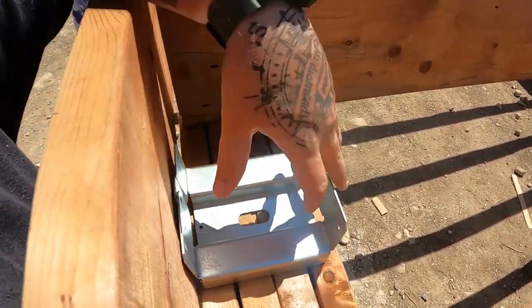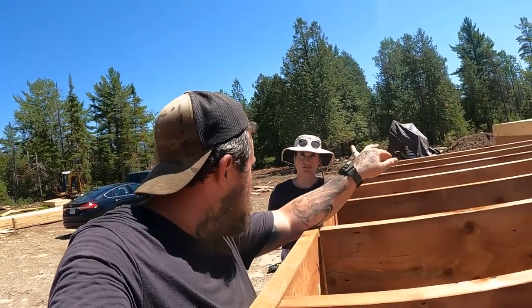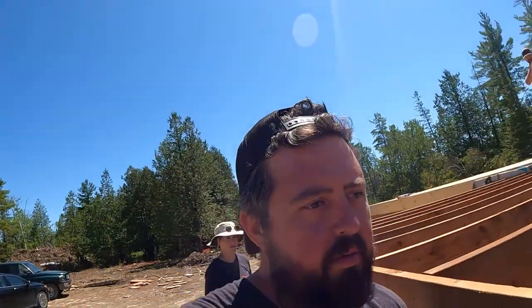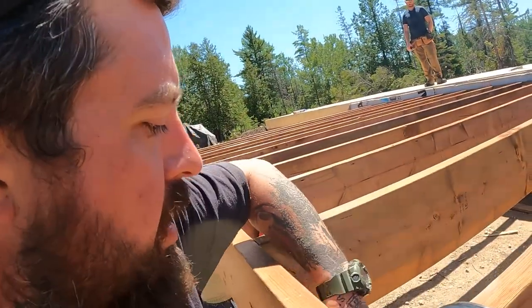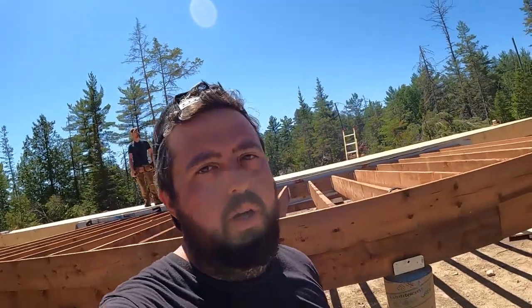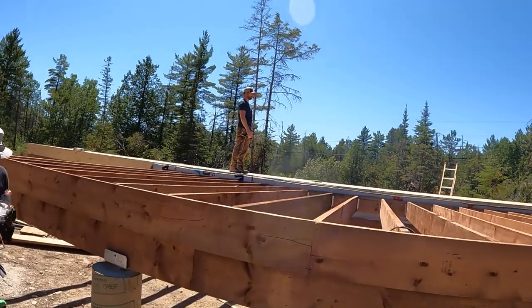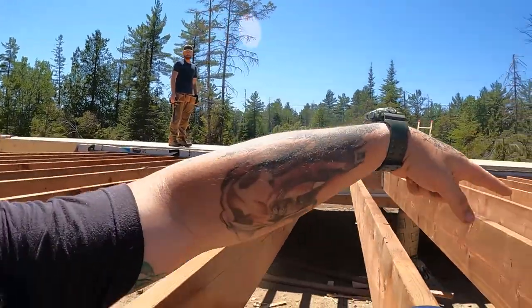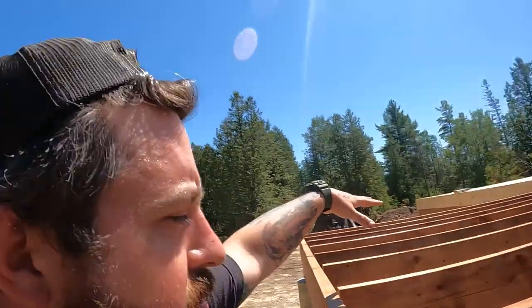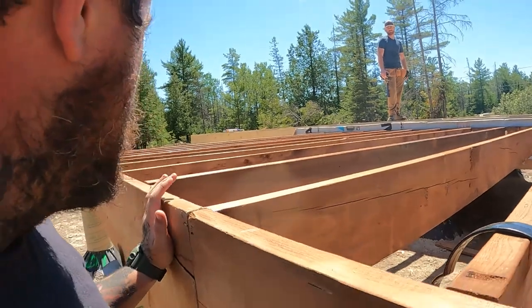So we have to go to the hardware store. We're going to get the 6x6x8 pressure treat posts today. They have to be bigger than 8. Remind me. 6x6x10? That's correct. Okay, to get 6x6x10. Perfect. Now she reminded me. Okay, so we're going to do that. And then we're just going to pop them down there, fasten those in. And then for the time being, we're just actually going to support them with a couple triangles or whatever boards until we get the roof up, because we obviously have to build walls first. But that's pretty much done. So later today we'll do the blocking, then we'll throw plywood just for temporary and put up the posts, do this board, and that should be it, eh? I think so. That's it. That's how easy it is.